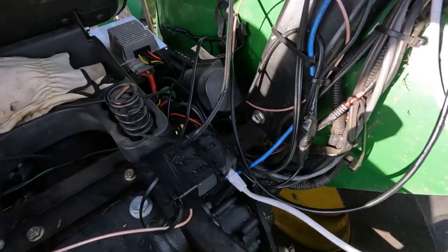Tried a few new things, and you might think it's absolutely nuts, but I'm going to run Panda. Basically, the Teensy and the BNO will be the only thing in the box doing anything, and then it'll be receiving a GPS signal over UDP, because UDP is super fast communications, and it's even faster than having it right on the board talking serial. So I don't see any reason why this shouldn't work.